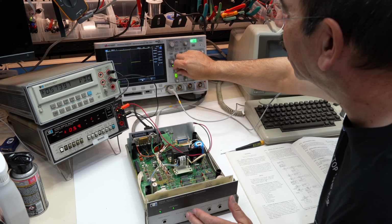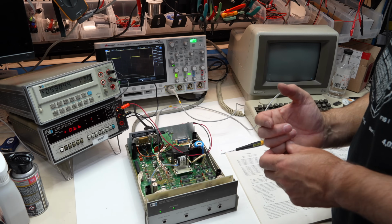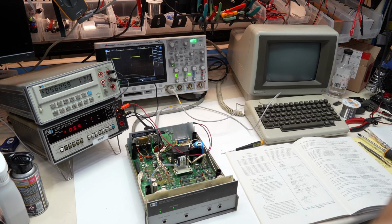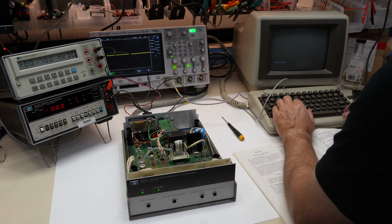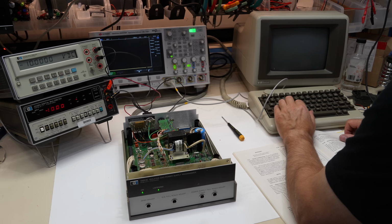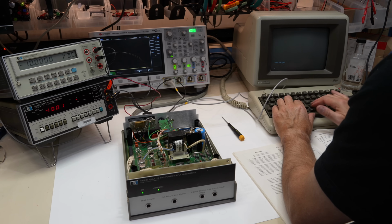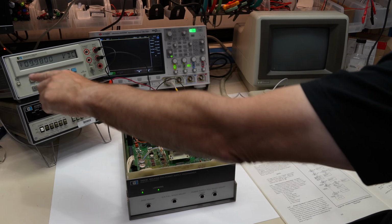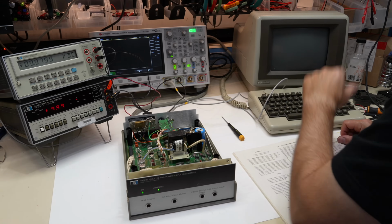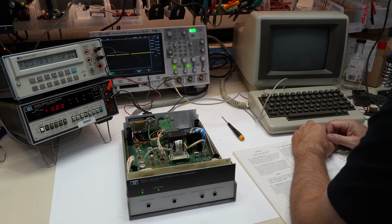Look at that. Okay. So same issue, I need to do the same contact cleaning and realign it, and probably it will work just as well. Moments later, and sure enough, now if I go to the minimum, it should be -10. It's minus 10 with 4 zeros in the decimals. Maximum should be 9.98 volts, and it's 9.98000. That should be the zero, which I could never achieve before.